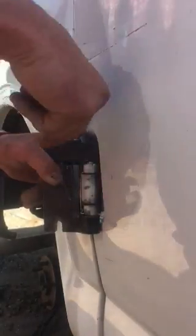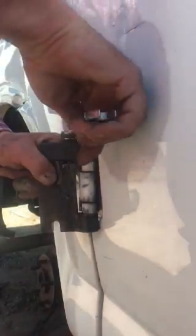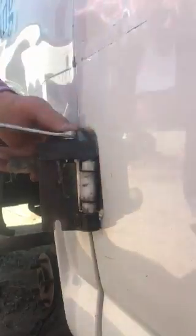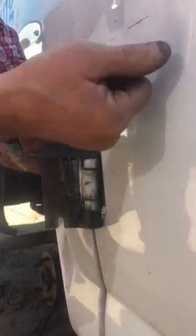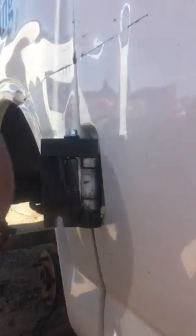You can see that loosened up considerably. We're going to go ahead and pull it out toward the end of the cantilever piece, or top, and continue to press the pin out. We're starting to get fairly tight — not too much of a load for the puller yet, but just for safety's sake, we're going to go ahead and pop it again.